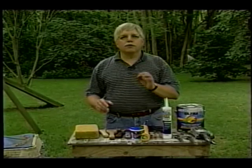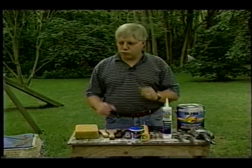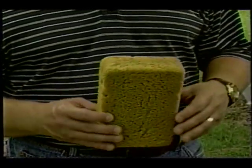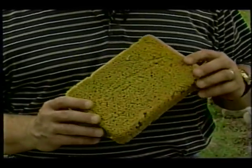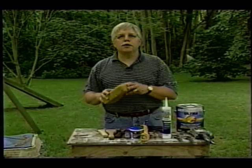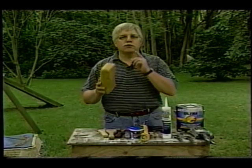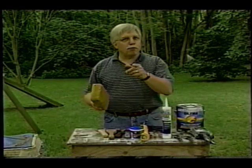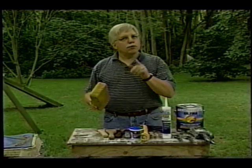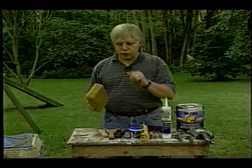Here are the tools I like to use and I'll tell you why. The first thing I use is just a regular sponge — the same sponge I use to wash my car. Read the label of any paint can and it says apply the paint to a clean, dry surface. That's so important. Just wash the house like you would wash your car. Be careful of power washers — sometimes they can spray water deep into the wood and you really don't want that.